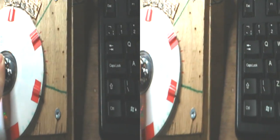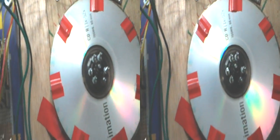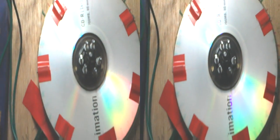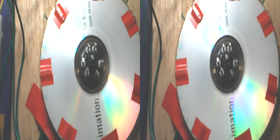88% mark, which is actually warming up that spindle now, because there's 3 volts on the power supply, and we're actually delivering 88% of that. If it was 84, that would be 11 twelfths, wouldn't it? No, 96 would be 11, so it's 10 twelfths, so it's 5 sixths. Yes, about 5 sixths. Okay, 3 volts. 5 sixths of 3 volts is 2.5, isn't it? So that's actually running at 2.5 volts.